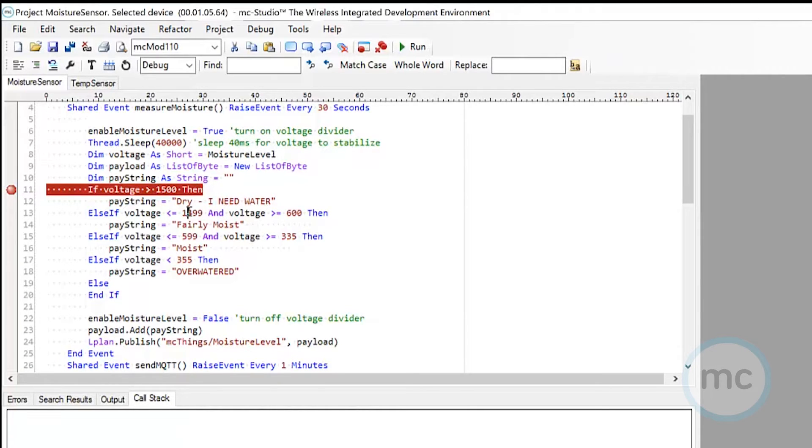This is a great feature. Now if you buy a sensor that isn't the exact same one I have, you might need to calibrate it. You might also need to calibrate depending on the soil type, and my definition of moist soil might differ from yours. You can play with this, and it's really easy using the debug feature — adding or removing breakpoints to get variables back from the module.